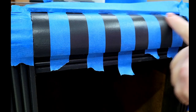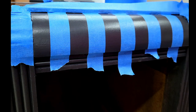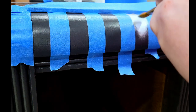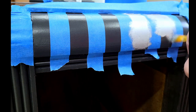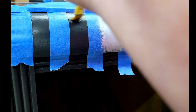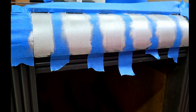Now that our top coat is dry, we're going to take a bit of rub and buff in silver and make those lines. Now remember, it's always best practice to topcoat a piece before you do waxes — the reason is you have more control, so if anything goes wrong you can just take a little bit of mineral spirits and fix those mistakes. We'll let that sit, then remove the tape, do the other side, and move on to the next part.